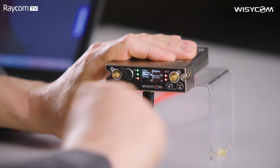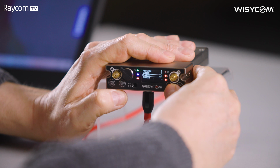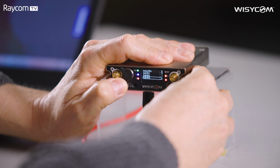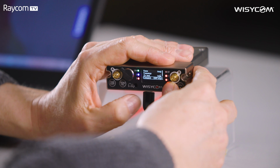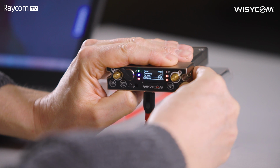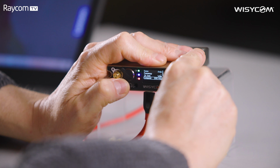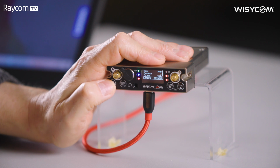And of course the biggest reason for having this firmware is to enable the new ENS Compander. To select the new Compander, just press Menu, Setup, and let's change Receiver 3 to ENS, select. I'm there. Compander is currently ENR, select again, it flashes, and then just change it: flat, ENR, ENC, and of course ENS. Press select again to save, and that's channel 3, now on the ENS Compander.